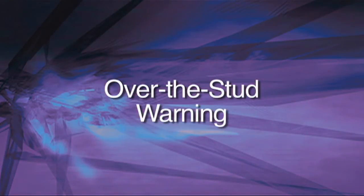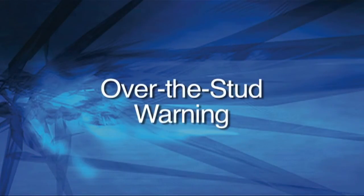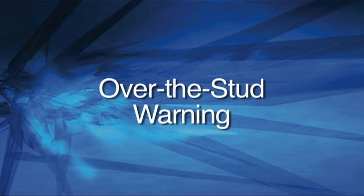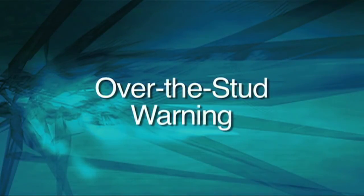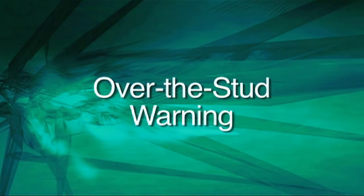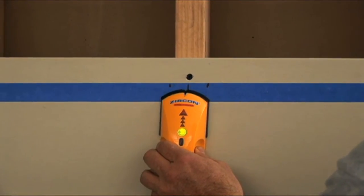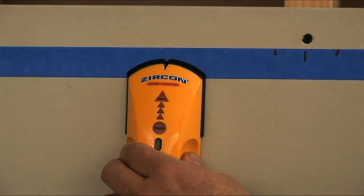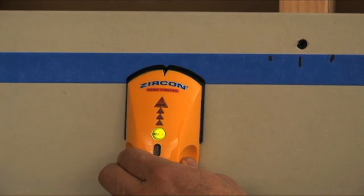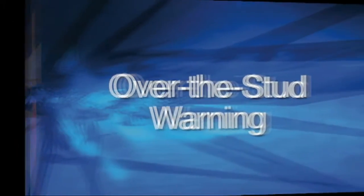Over the stud warning. Calibrating an electronic stud finder over a stud used to cause a problem that would lead to inaccurate results. In an effort to make our products as hassle-free as possible, we took that worry away. Our stud sensor and multi-scanner products are smart enough to know when something isn't quite right. If you happen to start scanning over a stud and then move away from it, the tool will beep and blink continuously. This indicates a calibration error. Simply move the tool a few inches to the left or right and try again.